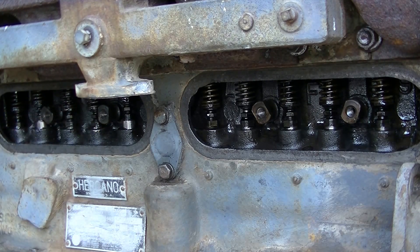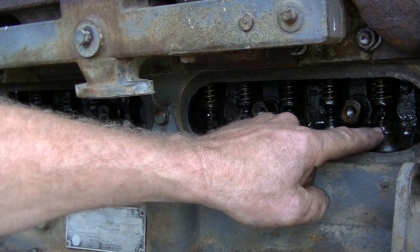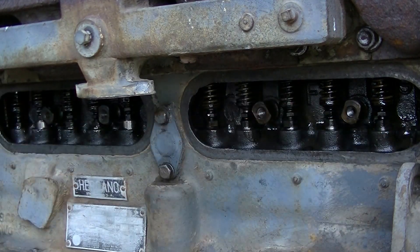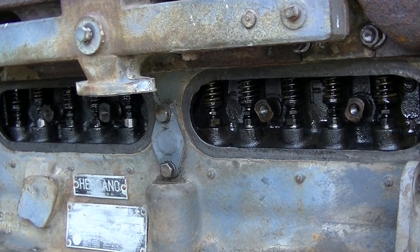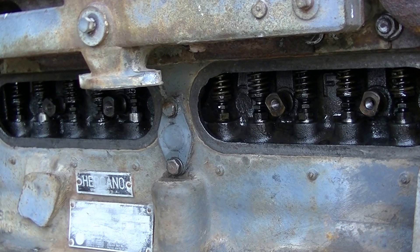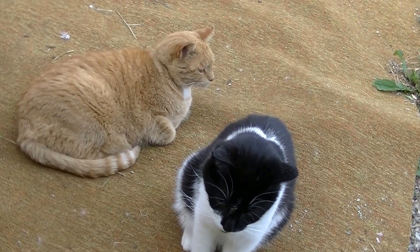When it comes time to set the magneto, I'll find those marks again on the flywheel. I'll get a rough adjustment by coming back to number six cylinder in the rocking position, which tells me that number one cylinder is at top dead center on compression. I'll be able to set the magneto and time it from there. My lovely assistants and I thank you for watching.